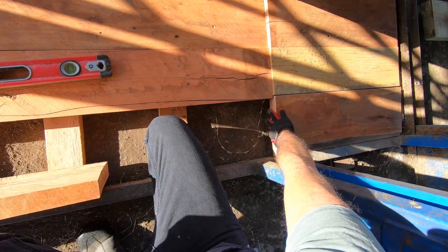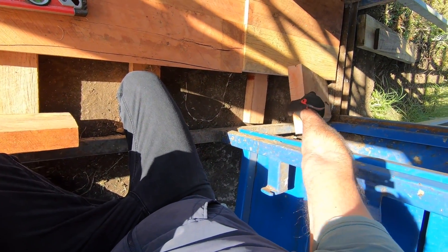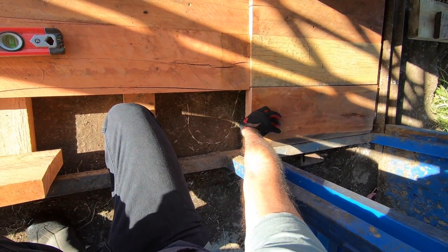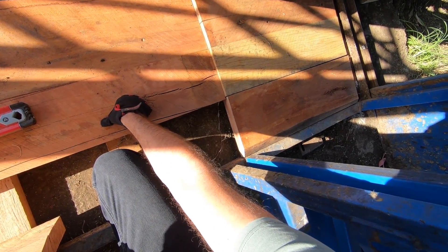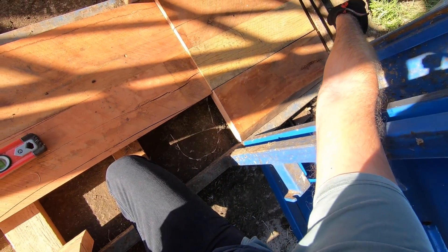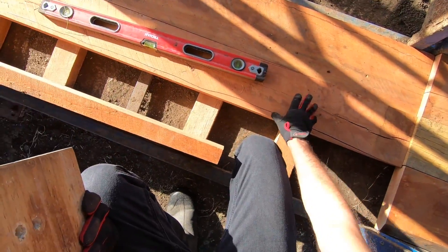This is the kit gate platform. You can see I've put some 2x4s under there and it's about 780mm long by 700mm wide. The cows come through there and step up onto the kit gate platform and then onto the weighing platform.